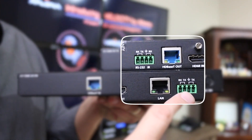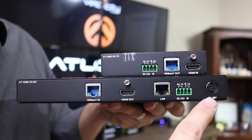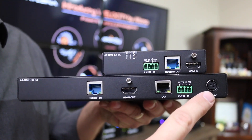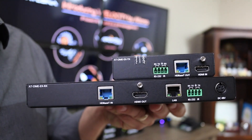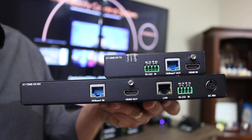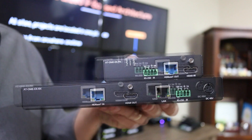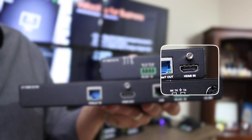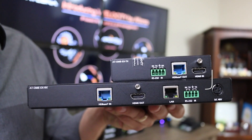The green Phoenix ports on both devices are for RS232 control. There's also a 48-volt power input on the receiver — the receiver is powered and it sends power over the category cable to the transmitter, so no need to apply power to the transmitter. This is ideal since the transmitter is usually located on a finished conference room table or podium where we don't want a power supply. On the transmitter, you've also got a similar HDMI 2.0 input for 4K signals.